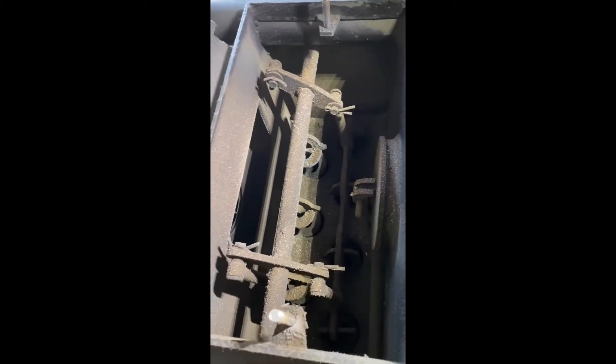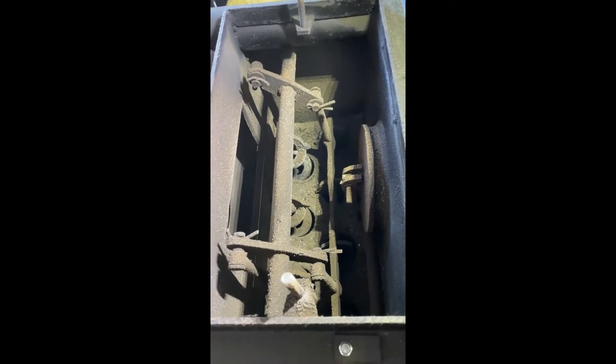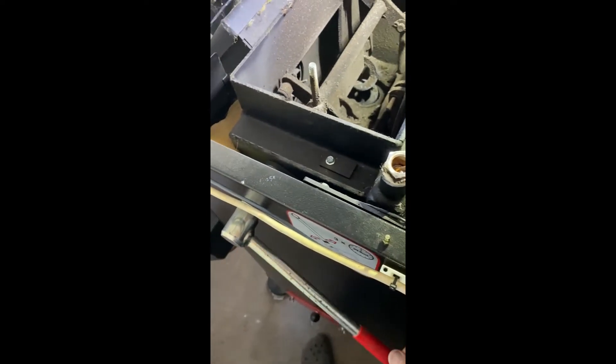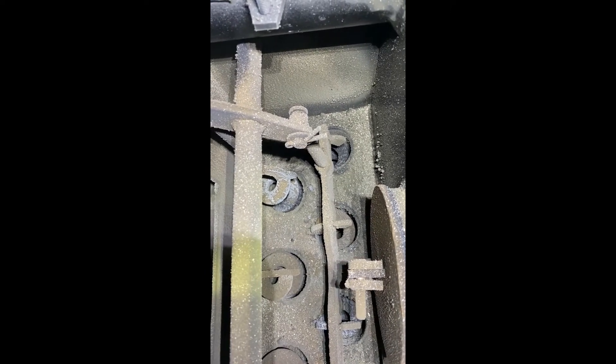There are turbulators in there. In the factory setup for cleaning these, it's pretty quick and easy — there's simply a lever on the side of the boiler that you move up and down, which moves the turbulators up and down. It works okay, but the problem is the turbulators are not a real close fit to the heat exchanger tubes. You really have to have some gross buildup to clean them, and there's still quite a bit of fly ash in there that limits your heat transfer.